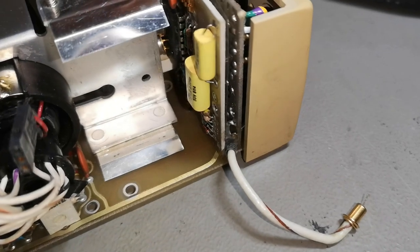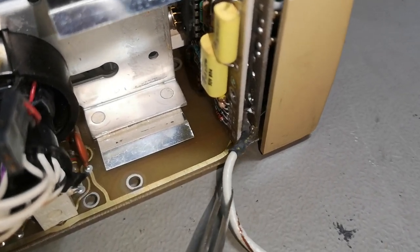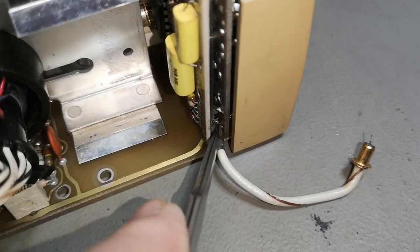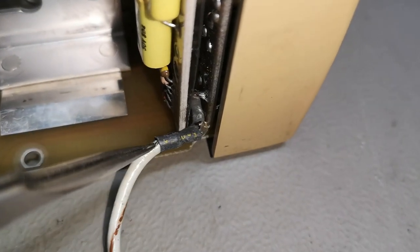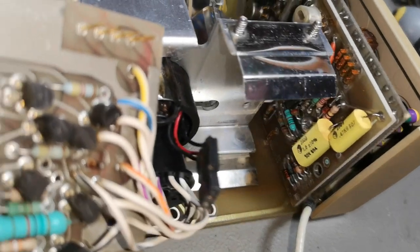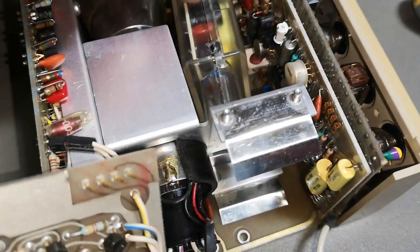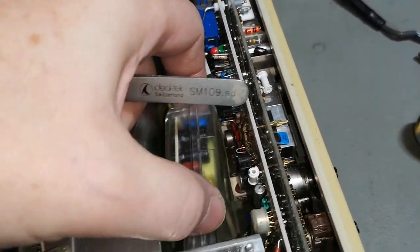I found the fault - this is the scope input. Look at that. Where is that supposed to be mounted? Down here there's probably a little pad - yes, there is. That is where it was supposed to be soldered to that little point. That broke off. Well, that should be possible to fix and then we'll be up and running. I really like it when stuff is working - that's going to be a great day. I could probably figure out how to mount the power supply too so it's not hanging loose.